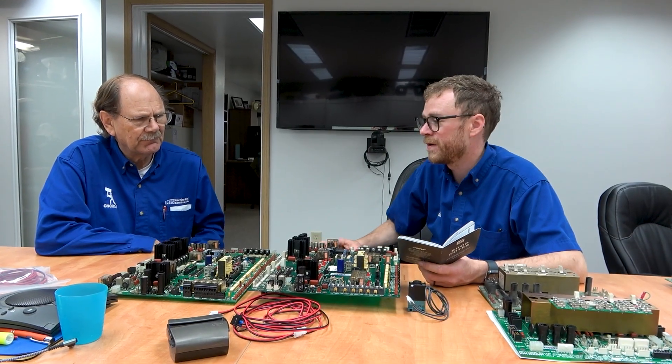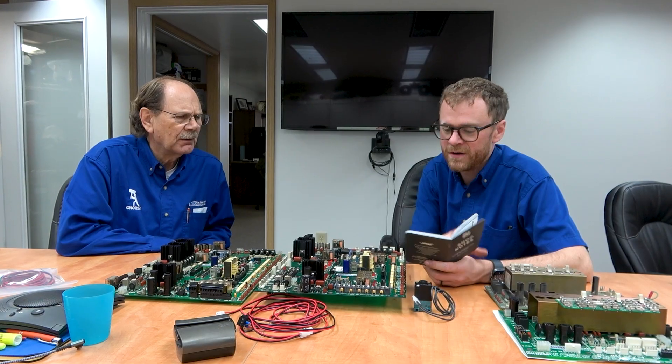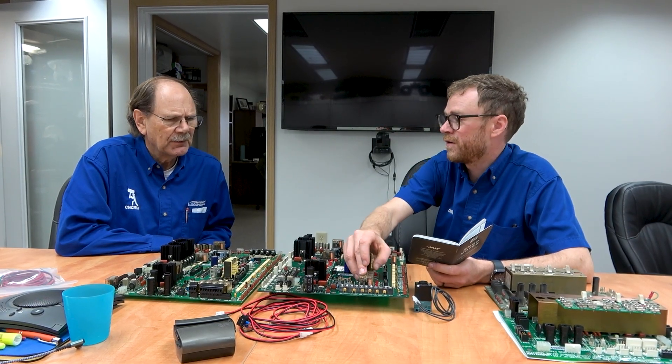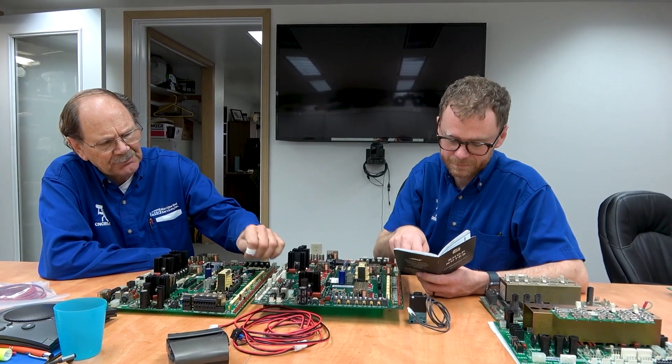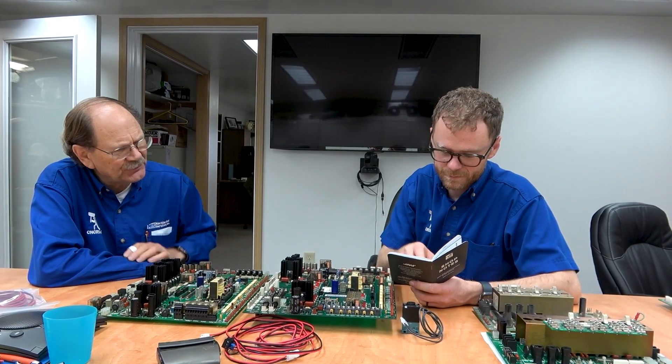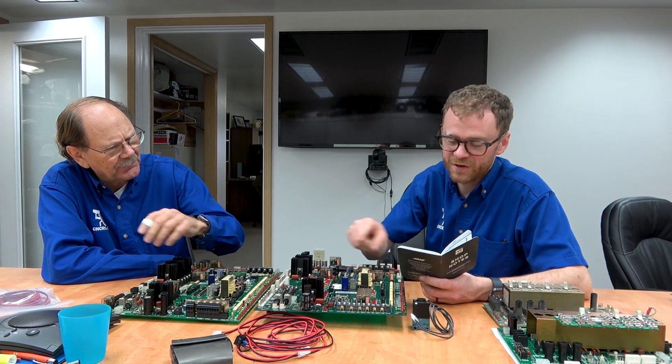You've got to be able to program it on and off. I think what it does is it sets them with one and turns them off with another. M21 turns it on unless you change a parameter to say you want to use the finish signal. So M21 will turn this on and looks for the finish signal.